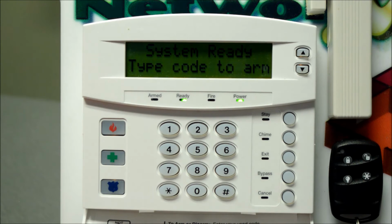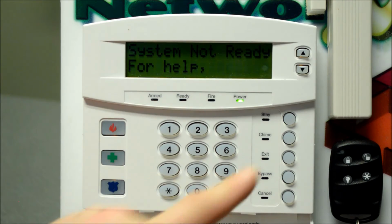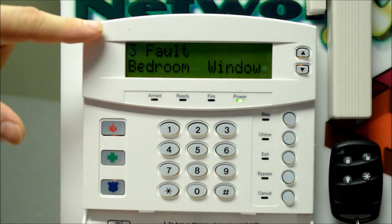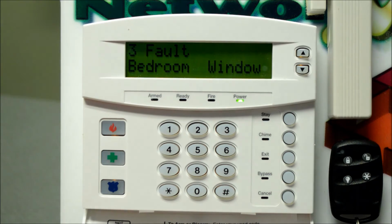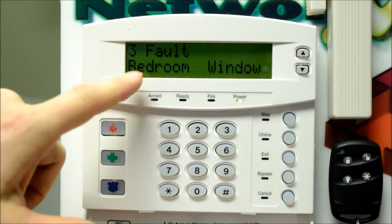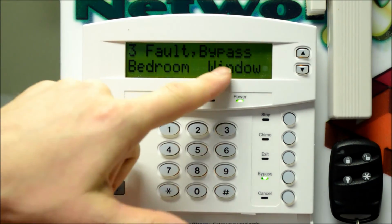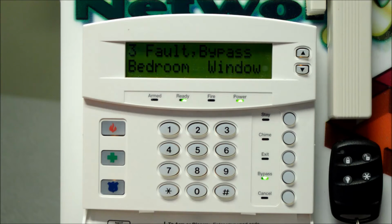And I'll simulate that by opening a zone here. It'll go from ready to arm to secure not ready. For help, press the arrow keys. I'm just going to show you that it's saying zone 3 fault bedroom window. All you do is once you've found the zone in the description on the screen, you just press the bypass button. It will come up and say bypass next to the zone. Press the pound key. And you'll notice now it says type code to arm, even though that zone is open.